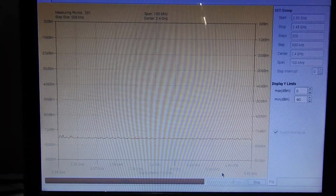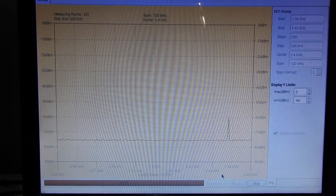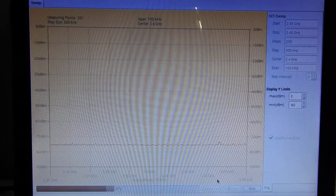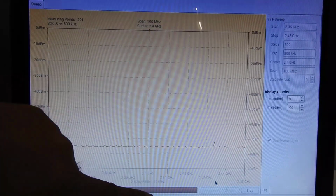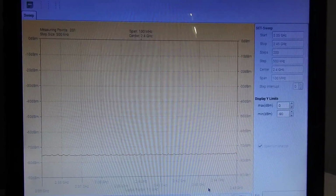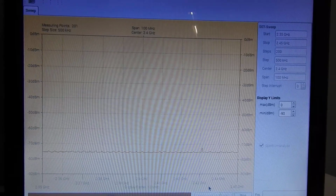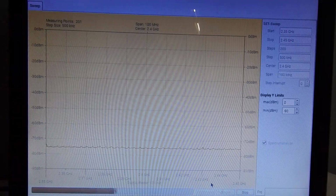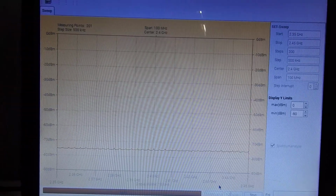Similarly, when we browse the internet through Wi-Fi, a similar signal will appear. Now we are connecting Wi-Fi from one device to the other device. Whenever any video or anything starts, this will receive the signal, with signal strength related to 2.4 to 2.45 gigahertz, as the data transfer from the Wi-Fi ranges in between the 2.4 to 2.45 gigahertz range. So here we can see the spike for that. Similarly, this spike is generated using Wi-Fi and Bluetooth.